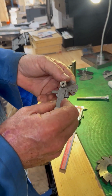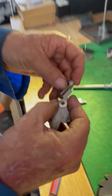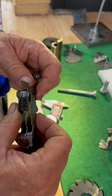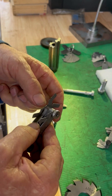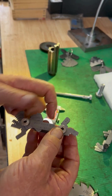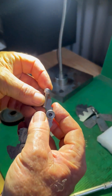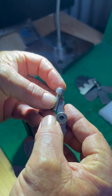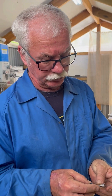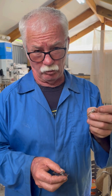I've got a rough idea — I think it's about 1.25 pitch. We'll put that on there... and I'm wrong, it's actually smaller than that, so it must be 1.0 pitch. Let me find the 1.0 gauge — it's probably in the next set, over here — and there it is at the top. Put that on there and you can see how it just drops in perfectly. So I know that is 6mm by 1. That's actually a standard metric size. You can go to your chart and double check, but now you know — if you need to buy a tap or get more bolts, that's going to be a 6mm by 1mm pitch bolt.